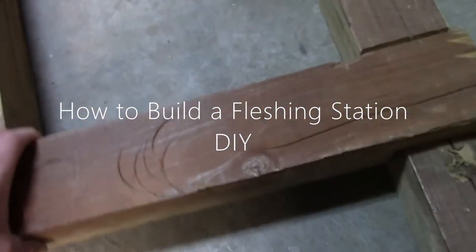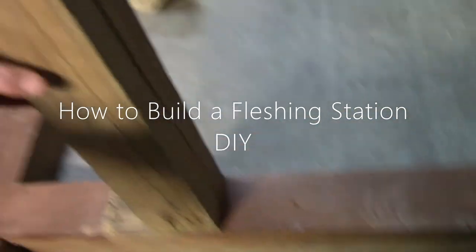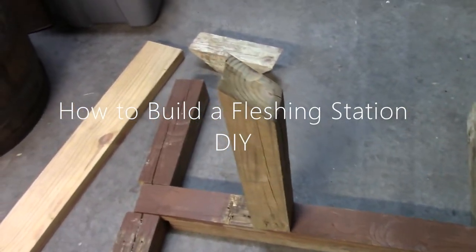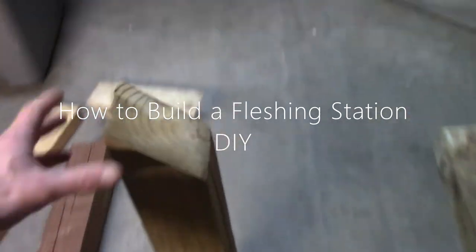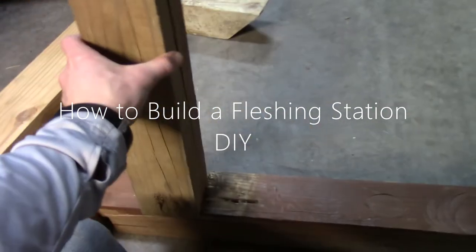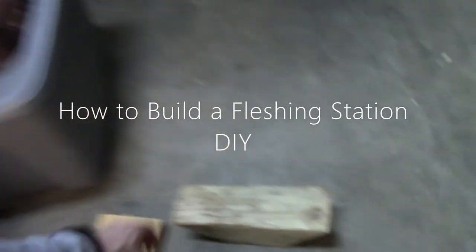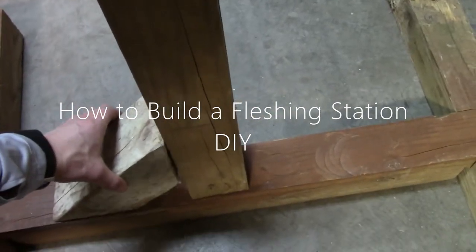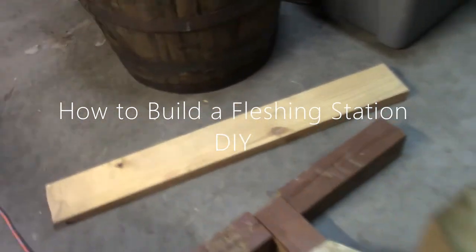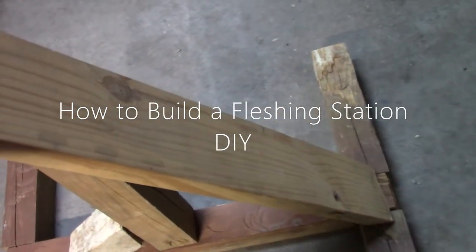It's going to fit right in here, and once I secure that down I'm going to have a support beam that's going to pretty much cover the angle that I want. Don't worry about what angle you cut here because you can move this back and forth, which is going to give you the angle you want. I've got another piece over here that's going to be a little bit of support, and then of course I've got a two by six — I think I cut it about 40 inches — so I'm going to secure that.